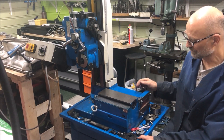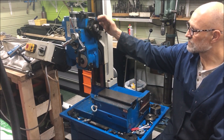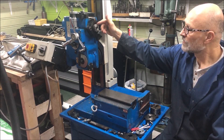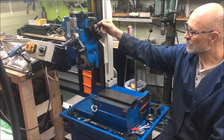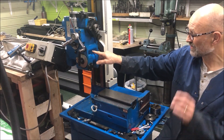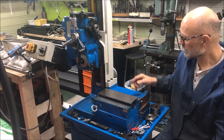For example, the Golmatic has ISO 30, this is MT2 — Morse Taper 2 — and it has 2,800 RPM. It's a geared head like the Golmatic, but the Golmatic has over 4K as max RPM, so it's a little bit heftier.